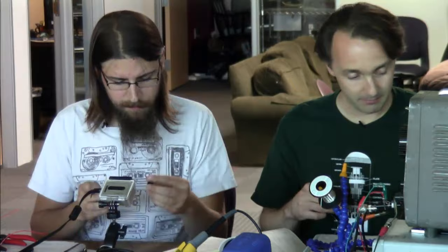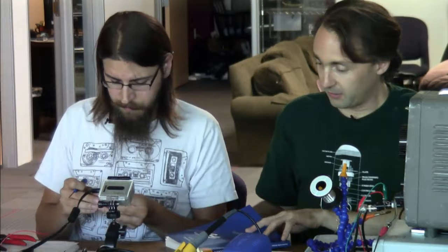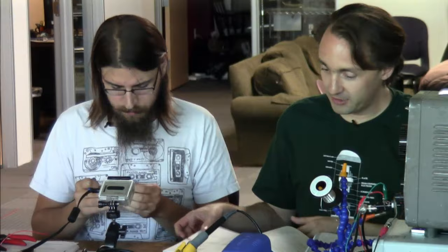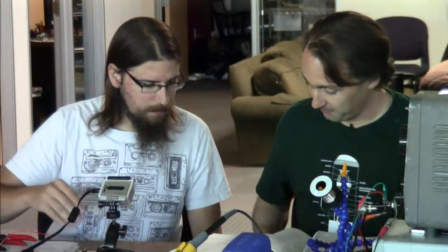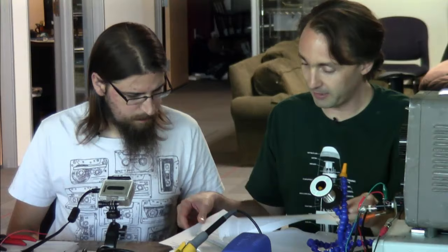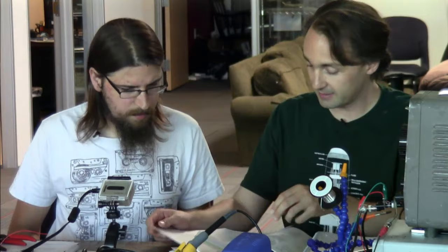In doing the background research for this SparkFun Live, in the good old National Semiconductor Audio Radio Handbook, they have a pretty detailed derivation of a RIAA preamp. Pages and pages of equations to be solved to figure out what to do. And in the end, they turn up with component values that are pretty hard to find. In doing a little further research, I found a simplified schematic with component values already recommended. It was National Semiconductor, now it's Texas Instruments, and this is AppNote 346.